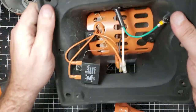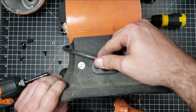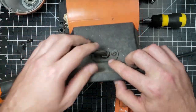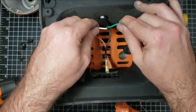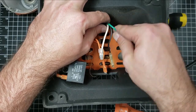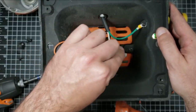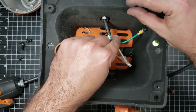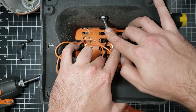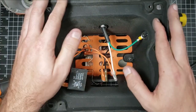There are some little odds and ends left: another piece of sheet metal, another hard plastic injection-molded piece. The wire is not too glamorous to talk about, but it's probably pultruded — with the shielding on it, basically on a conveyor line that's pulling the wires and then molten rubber — probably PVC, which is what most wire shielding is — is melted around it just like a hot glue gun, and the wires are extruded out with it.